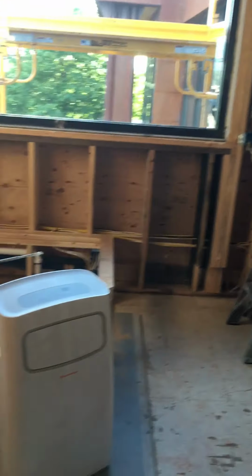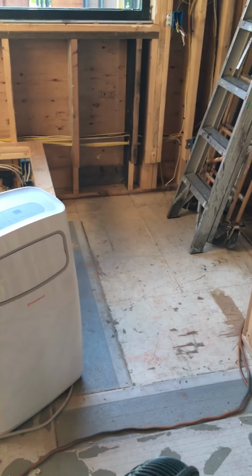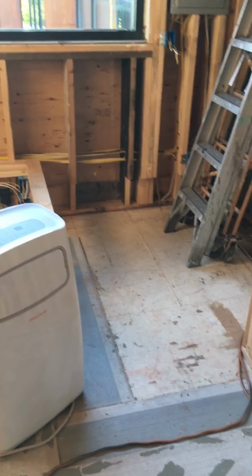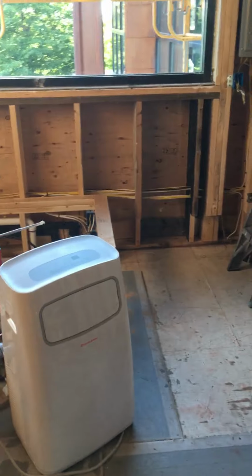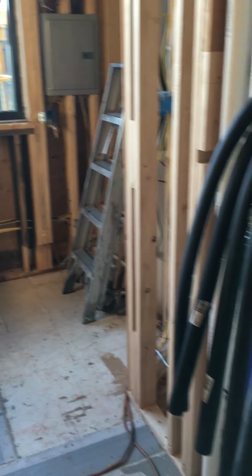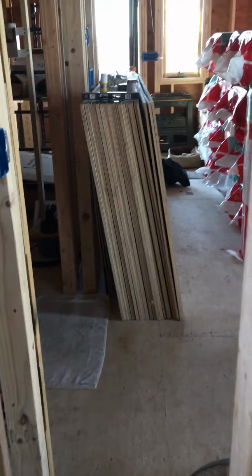That's what's next. We got AC in here because when we go to put on our teak tongue and groove, we're probably going to get some dehumidifiers up here too, because we don't want a lot of moisture in here when we're putting our tongue and groove. We'll actually try to control the space and keep the moisture low when we go to install.